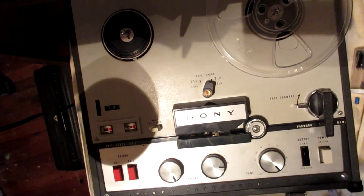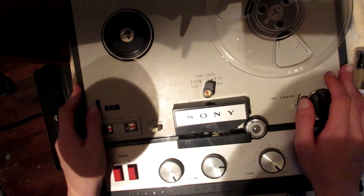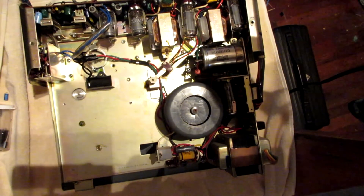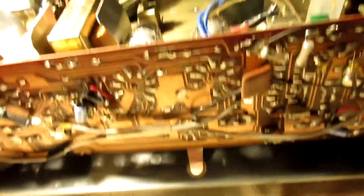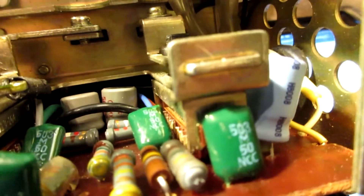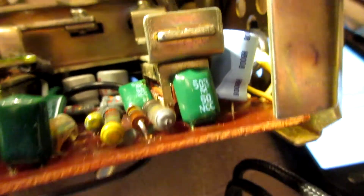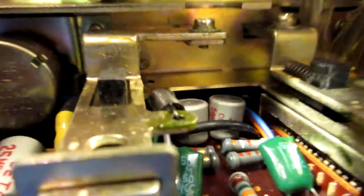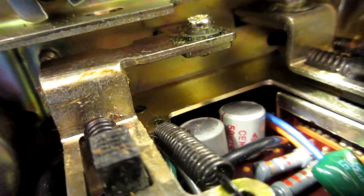Let's take off the Christmas decorations. So I replaced the two 10UFs that were right here. Now these capacitors were a source of the problem. I didn't fix it fully because these are the record switches right here. Those 50s right there, which I can't get to — those two 50s — I feel like those are causing these issues because they're in circuit with the switches.